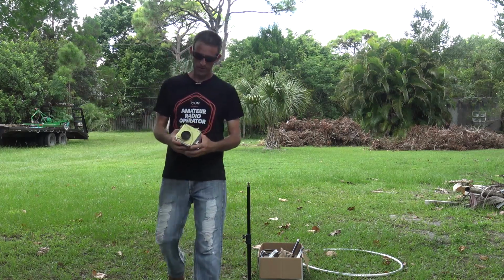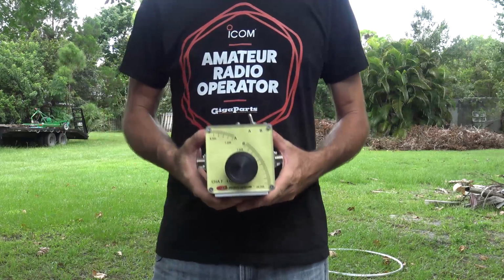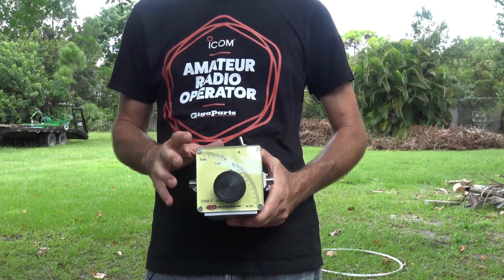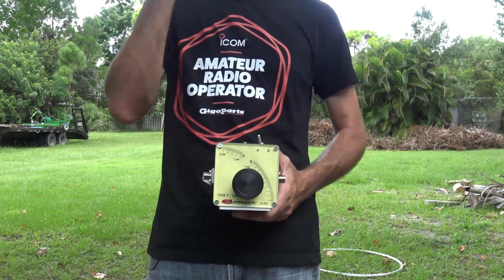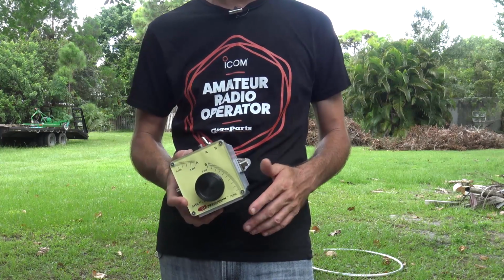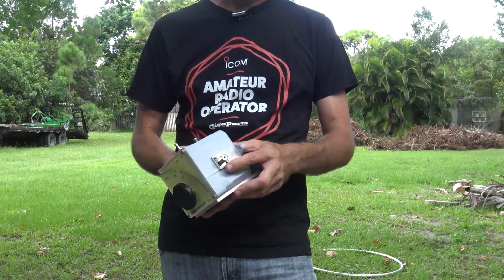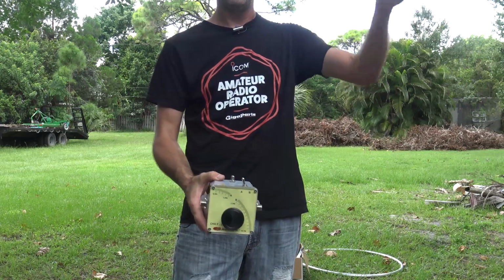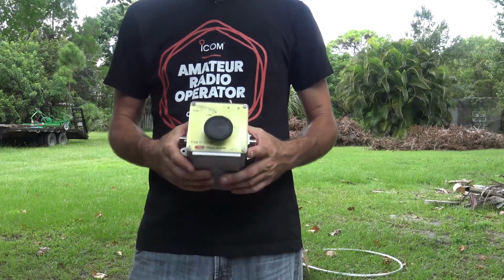I'm going to show you this close up. This is the magic right here of this antenna first. This is the tuning capacitor. Now, magnetic loops have an entire theory and education around them. I know about how it works, sort of, but I am in no way a technical savant to tell you all the little things. Jan knows, Chameleon knows. But in a nutshell, this is a variable capacitor. On the side of your loop, you see there's SO-239s. The loop is made out of coax, comes with it, goes up and around, and it essentially makes a radiating loop, okay? We'll get into more later.